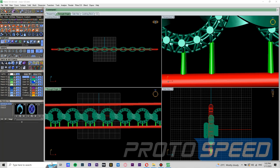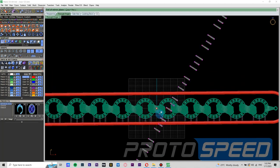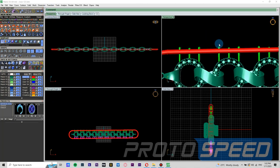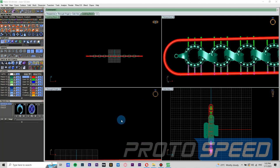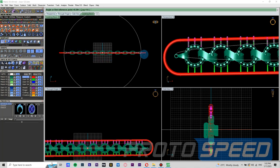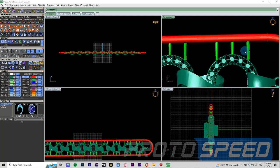Now as we are done adjusting the supports, we can measure them to the top side of the pipe. But we can see that some of the supports are peeking through the top pipe. So what we are going to do is go to the look-down perspective, select the supports, and rotate them. Pressing F4, select the center, and we are going to rotate them 180 degrees. Now we can see the supports are peeking — we will check and everything seems to be okay.